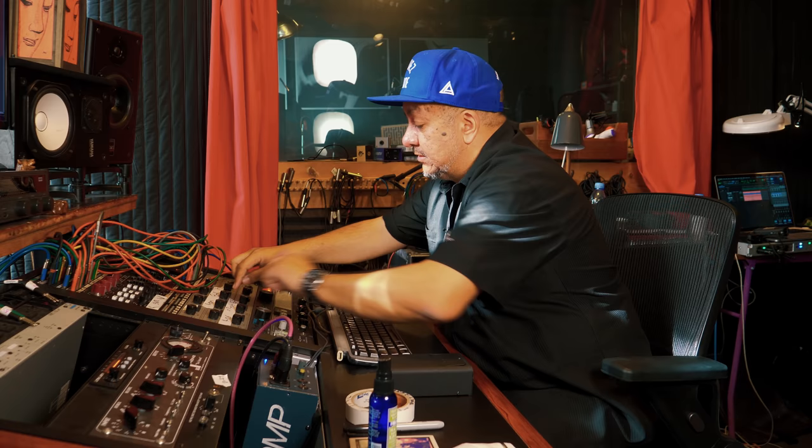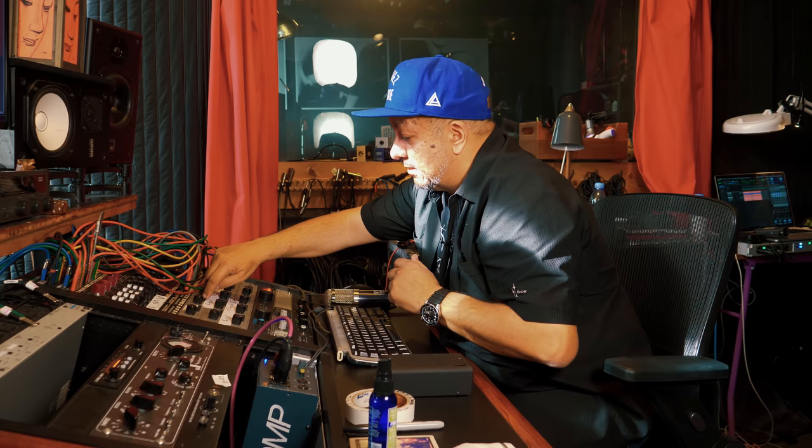Eric is going to hold the Cricket on every single mic through the session. You'll be able to see it come through on the Pro Tools screen, coming through my speakers. I already changed things in my DAW and hardware, so I'm going to reverse that — undo what I corrected with the Cricket — and you can see how that changed my world. I'm undoing the corrections now. Everything is reset. The only thing remaining out of phase is the bottom of the snare, which is general rule — you typically have that out of phase.